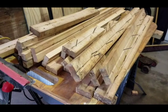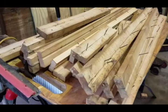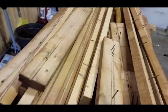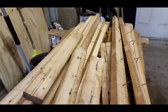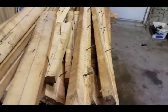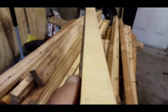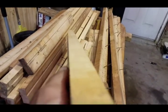Okay, so I'm starting work on a herringbone style coffee table made out of reclaimed bowling alley maple. So what I got here is some maple that I'm taking apart and denailing. You can see some pieces of the nails. This is one I've already denailed. I've already got the bowling alley wax planed down off of it.